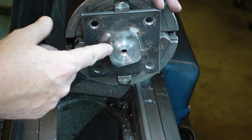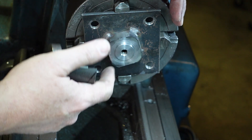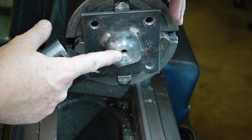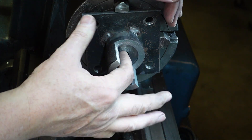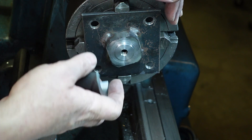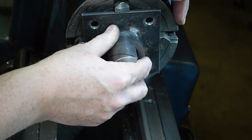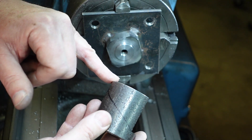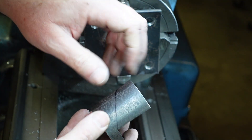I've turned a register on the inside here and a matching register on the fixture. There's a hole in the middle — 3/8-16 TPI — so that's good because that's the hole it's designed for and it'll fit on like so and I can clamp that down. To make it a bit more secure I'm going to put a small pin in there, and on the bottom of these I'll put a pin in as well so it doesn't rotate on me. I'm going to trim that off on the bandsaw to get close so I'm not taking large cuts on the mill, and then I get to set this up to put the teeth in.